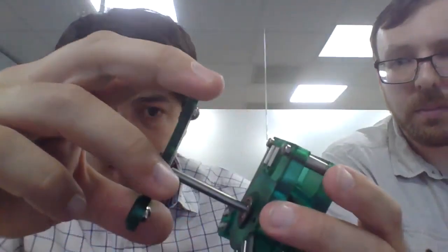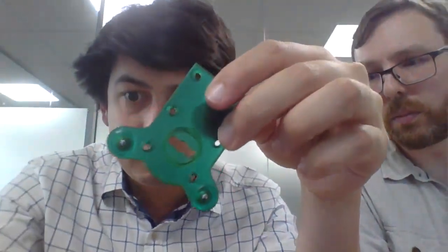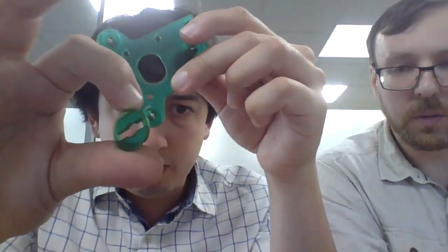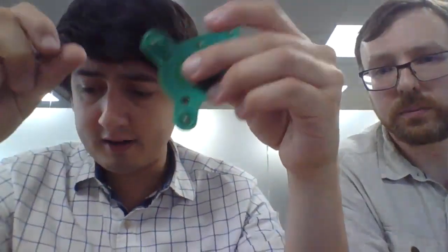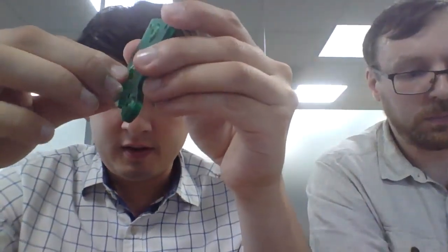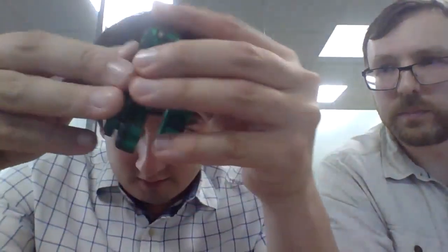The ramp ring is a separate press fit part because we don't want to make that out of aluminium, because aluminium is not the finest bearing surface material in the world. So this part will be made out of some bearing bronze, brass. So it'll be a brass steel contact, bronze steel contact. Because this part is spring preloaded and bears plainly on there, in order to not wear or otherwise mush the surface with the spring preloaded hardened steel pin, that would be a nice bearing surface made of bronze. And really, that kind of shows how it goes.